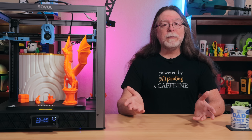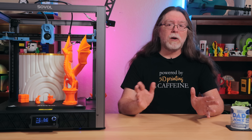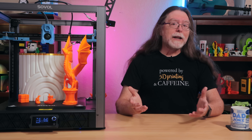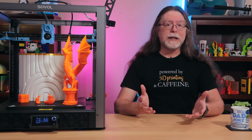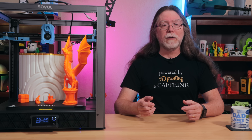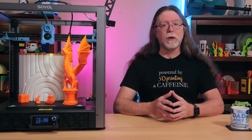Here's what I don't like. The control knob on the screen can be a little flaky — sometimes it selects the menu item above or below the one that was highlighted when you pressed the knob, and other times it doesn't register a click at all. Also, the bottom of the tool head cover — the blue thing with the parts cooling blower built into it — is very close to the level of the nozzle. There's not a lot of clearance between it and the print, which increases the possibility of the tool head snagging on a print if part of the model curls up. When that happens, the magnetically attached tool head cover can experience a rapid, unexpected detachment event. The printer can't detect when that happens and will continue printing — it's happened to me twice already, and it can cause a print to fail or damage the fan's wires or power socket on the tool head circuit board. And last: the noise level. I think this printer's louder than it needed to be.